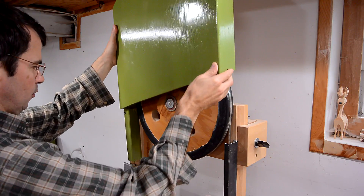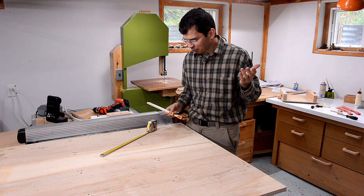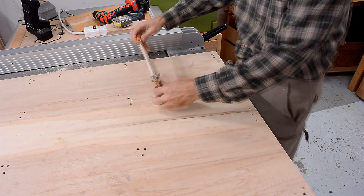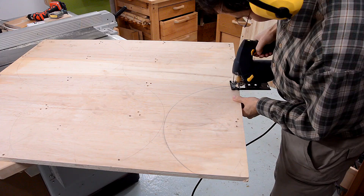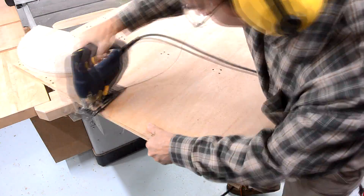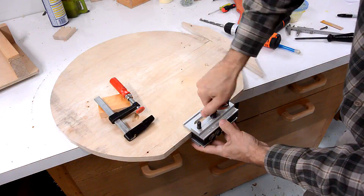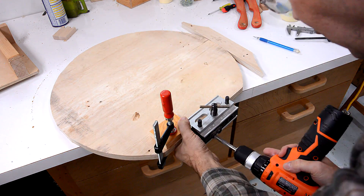The design of these wheels is going to be very similar to those on my 16-inch bandsaw. It's best to start with good materials, but I like to use old scrap — like this shipping crate plywood. The plywood wasn't big enough for 4 contiguous circles, so I'm piecing it together and reinforcing it with dowels.